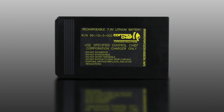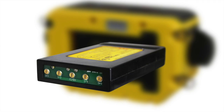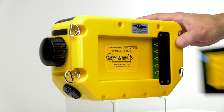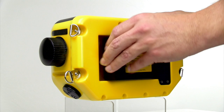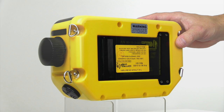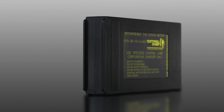The OCU is powered by a 7.4 volt rechargeable lithium ion battery pack that is installed in the back of the unit. Insert the battery pack into the rear well so that the metal pads contact the pins on the OCU. The battery is secured by its own locking lip and retaining clip at the back wall.